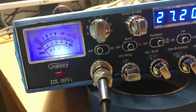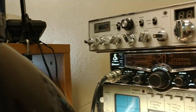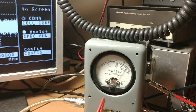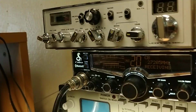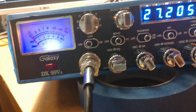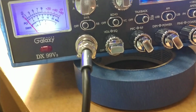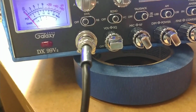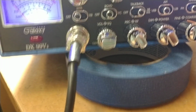This is from a 9-watt carrier, 100% modulation. Hello, radio, 1-2-3-4-5-4-3-2-1, audio check. Bumping up there about 36 watts PEP power under voice. And if you listen to that, it sounds the same. The modulation, 100% to 100%, I keep preaching that. It doesn't matter from a 1-watt dead key or a 9-watt dead key. It doesn't sound wound tight. It's loud and proud.